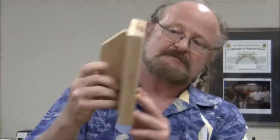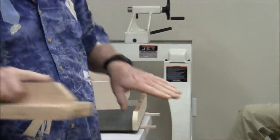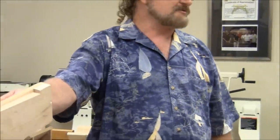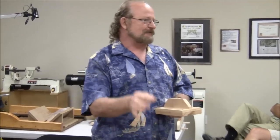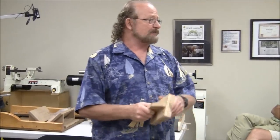This is for cutting shims. You can see it starts from zero down to about a quarter inch. Set it on the table saw, put your block of wood in it, and you push both pieces through at the same time. You can cut shims all day. And like I said, on these pieces, sometimes you cut a block and you try to cut it exact to fit down and to snug it up. I just leave myself a little room now, and I just take my shims and I knock my shims in, and I don't have to fit the block perfectly.